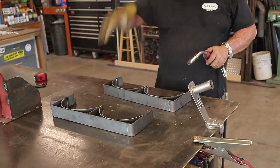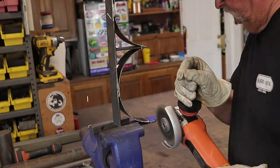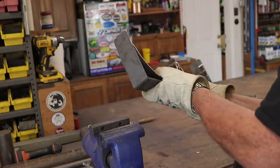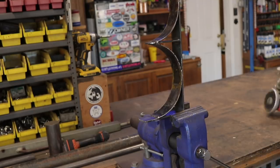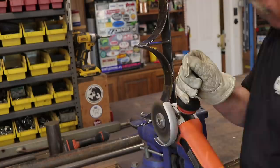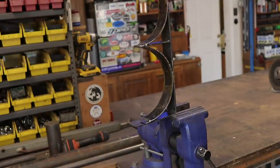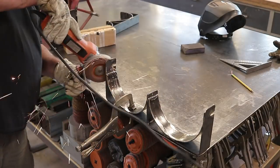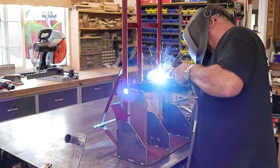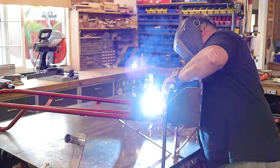Using a quarter-inch grinding wheel, I'm cutting a groove on either side of this piece — this is where the chain is going to sit. It's some pretty thick chain so it needs to be able to slide in there. I made a nice quarter-inch wide groove on the inside. Then I took the flap disc to clean things up. I got a couple of two-by-fours to hold everything nice and flat as my base to get the top piece leveled as well.